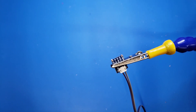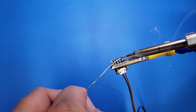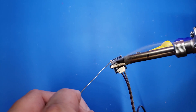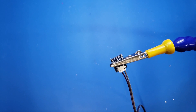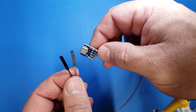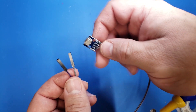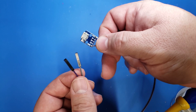The fastest way to get this project running is to take this USB breakout and solder two leads on it. The leads I'm soldering here already come with connectors on the other end — I'm just soldering in the ground and the 5-volt power. Once this is done, it's ready to install to the ESP32. The other advantage of using this USB connector is that you can use one of the phone batteries you use to charge your cell phone, making the ESP32 cam mobile.